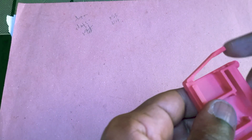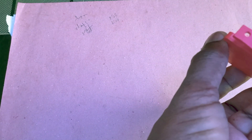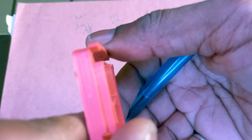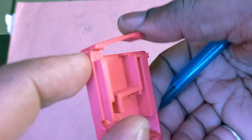The second issue is also about the arm. This main part was printed with this side laying flat on the bed, which means the different layers go horizontally all along the arm. When too much pressure is applied, the layers tend to separate and the arm breaks at this level here. You can see it is broken and this weakened the arm.